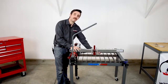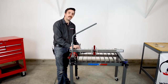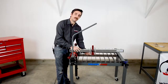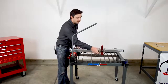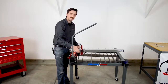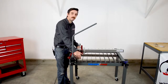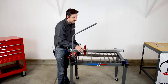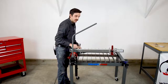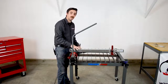We cover how to adjust that in a later video, so I won't get into it here. The third way that it can be out of alignment is that the gantry tube can be out of parallelism to the slat bed. What that means is, if a torch was installed in the torch slide and traversed from one end of the gantry to the other, if it was out of parallel, the gap between the torch slide and the slat bed would not be consistent from one end to the other. I know that this gantry is out of alignment because this end of the gantry is higher than the other end, so the gap between the torch and the material would be higher here. In this video we're going to show you how to cure that.